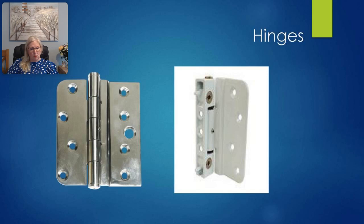The three types of adjustments are: compression, which allows movement away from or closer to the frame seal; vertical, which allows adjustment to raise or lower the door leaf; and lateral, which allows horizontal movement of the leaf within the frame. If a door is correctly manufactured and installed, only very minor adjustments should be necessary, if any at all.